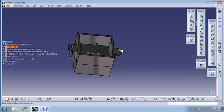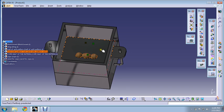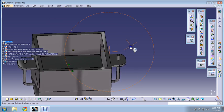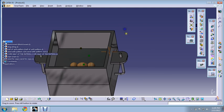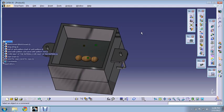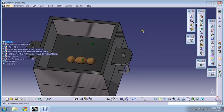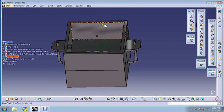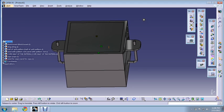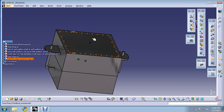Again, in similar fashion, we'll sprinkle the facing sand over the surface to provide a non-sticky layer. After that, we'll pour freshly prepared molding sand to some extent, and the remaining will be filled with backup sand to provide strength to bear the thermal stresses. The remaining sand will be struck off using a strike-off bar.